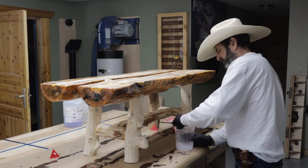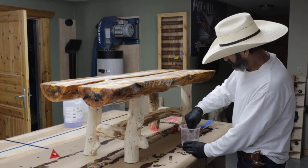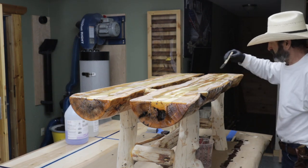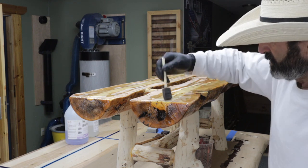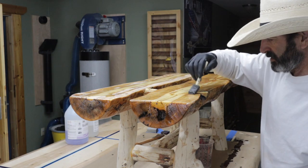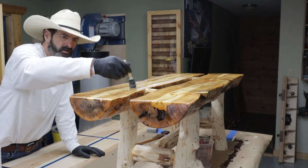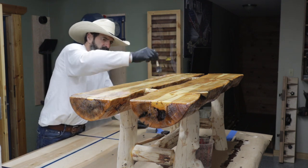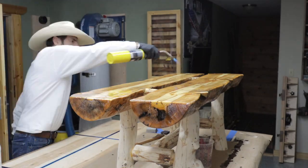Mix for three minutes all by hand and then apply the epoxy. It's back to the top again — I sand off all the little drips from the day before and get the whole top sanded. Right here I'm going to put hopefully the last coat on this top. This Super Clear epoxy I can highly recommend — I'm not sponsored or anything but it really works good. Just make sure the temperature of your room is above 70, don't overmix it, minimum of three minutes mixing. That's going to be the last coat on this whole thing — I do the top and then add another coat to all the ends. I basically had to mix epoxy five times for these two tops.